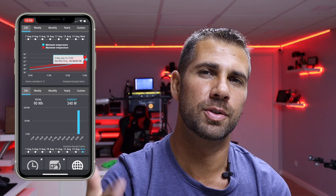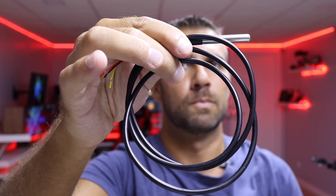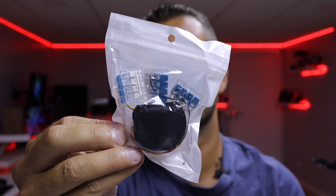This setup lets me use power from my solar PV system to heat water in winter without paying extra to the electric company. To get these two results with Sonoff I would need two devices: the TH16 and a Sonoff power meter. With the Shelly 1pm, everything is in one app on one device. The only extras needed are a temperature probe and an adapter — that's it.